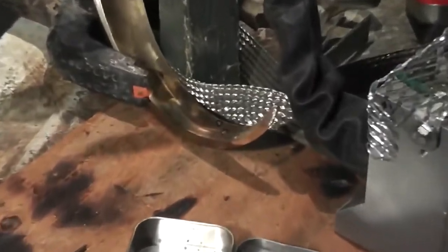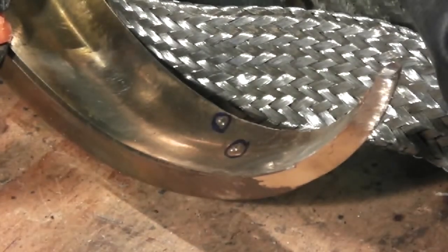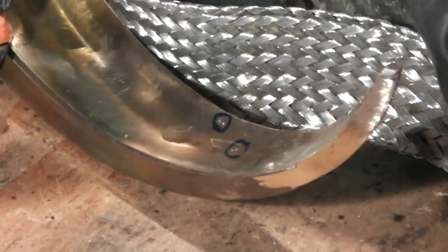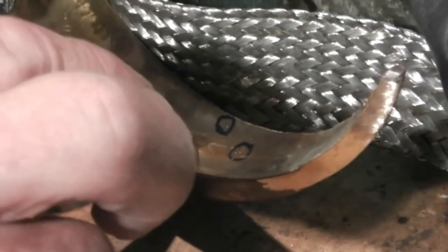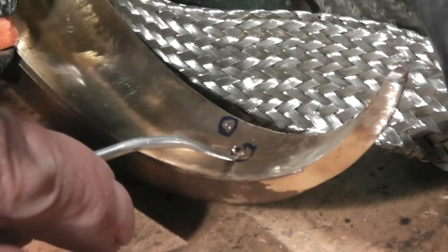This shows a piece of silicon bronze sculpture set up for welding some small marked and prepared pits. The area is fluxed and the pellet is moved into position using the flux to keep it in place, after a bit of indecision as to which pit to weld.